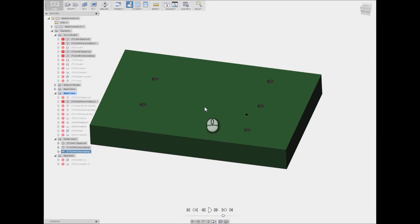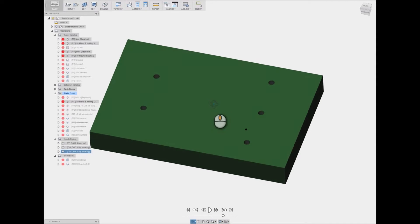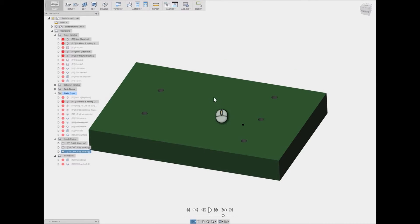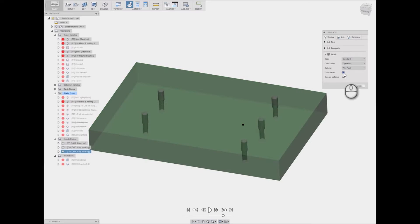I've kind of been trying to figure out how I wanted to secure the handles to the fixture, as well as locate the handles on the fixture so that it would be repeatable. I've decided to take a route that may be cheating a little bit — I'm going to use shoulder bolts to both locate and secure the handles to the fixture.